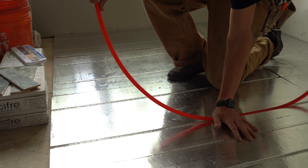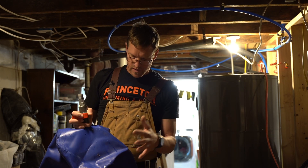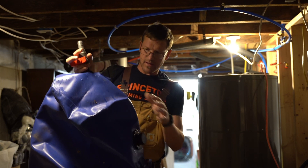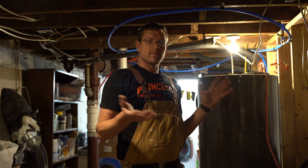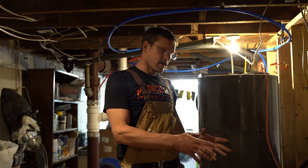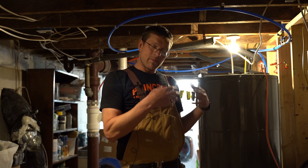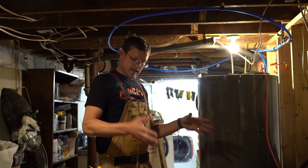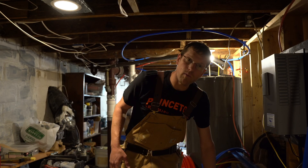One of the novel things I'm trying is thermal storage. I have these water bags — I'm getting one about five times bigger — and I'll store it in the crawl space over here. That lets me run my heat pump during the day when the sun is hitting my solar panels, take that electricity to make all the heating I need for the night, and store it in the bag. This decouples me from the energy dispatch problem: the sun only shines during the day, but I can store both heating and cooling for whenever I need it.